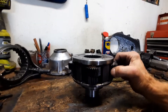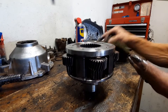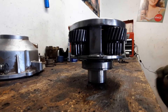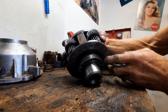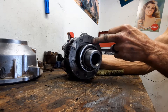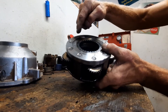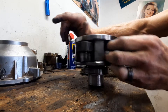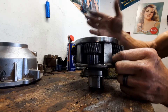I'm not sure why they use copper washers since copper is a really soft metal. Since Teraflex doesn't make this planetary gear set anymore, I'm going to attempt to fix it. There's a shaft that goes in here with punch marks to hold it, and it's welded on the other side. I'm going to grind these welds, take the cross shafts off each of the gears, and try to fix this — I might be wasting my time, I don't know.